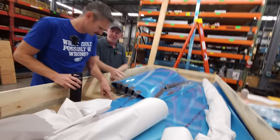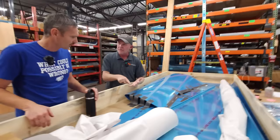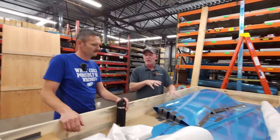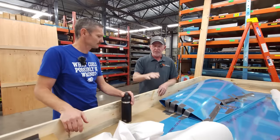These holes are already in place and it's a matched-holes system. These are the skins — the holes here line up with the holes in the substructure too. There's no jig; it's a self-jigging kit, so it puts itself together. You just line up the holes, check for burrs, deburr where necessary, and start riveting. Dimple where it's a dimpled kit and then start riveting it together. You start from scratch — from the beginning and go to airplane.